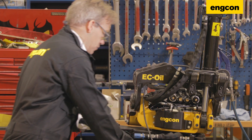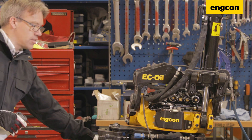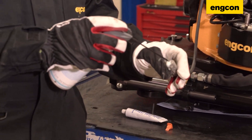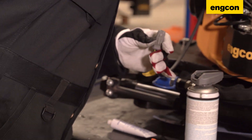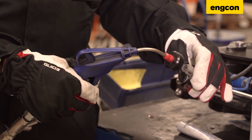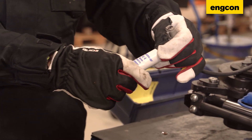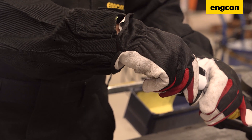To do that, the first thing we can do is to use our electric cleaner, and then afterwards when everything is clean, the dielectric compound. So we can just spray in the electric cleaner, dry it out perfectly — we can use some compressed air for that. And once we are sure it's perfectly dry, we use some dielectric compound, put it inside, just fill up the connector.